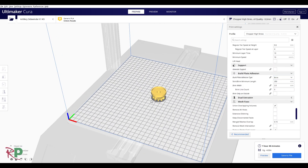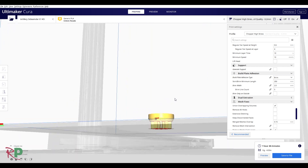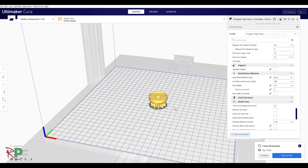I put a brim on this one because of the geometry — just to try and keep it as flat as possible. No supports needed. You may find it gets a bit stringy in places, but overall that won't affect the way the gear works. That's the second profile, and it's only used for about the last 5% of pieces — just gears and that sort of thing.